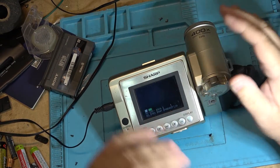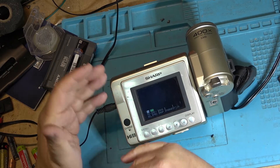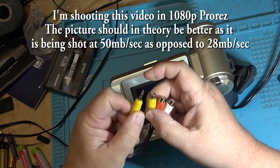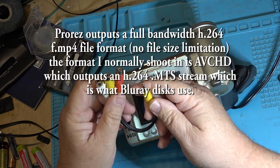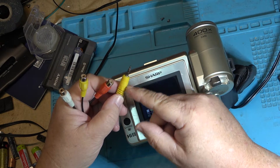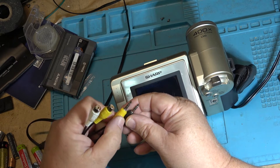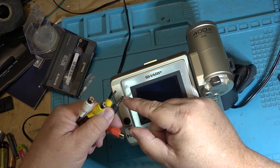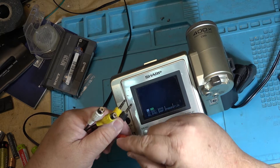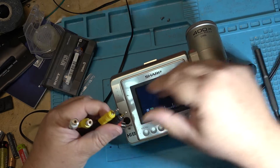This video is not so much about the discrepancy between the two plugs but the two patch cords — it's to make people aware that's what's out there. This is a mono camera. Some use a stereo plug, and there are multiple different configurations. There's Sony which has their own cable wired differently. This mono camera just uses a standard three-conductor stereo 3.5mm. One is tip-ring-ring-ground; the other is tip-ring-ground. Some devices use this as AV but it's not universal — some have reversed ground positions. It's all dependent on the device itself.